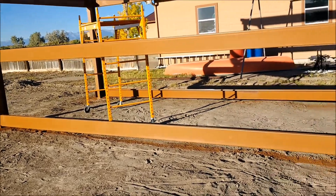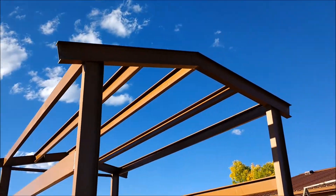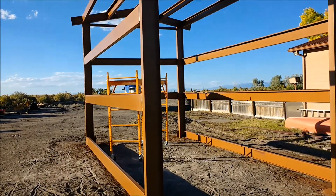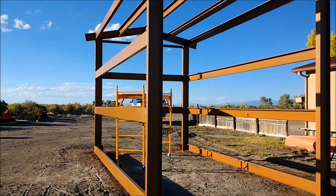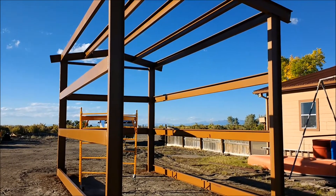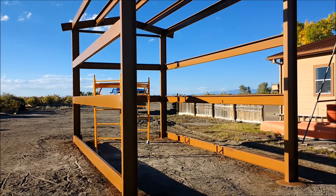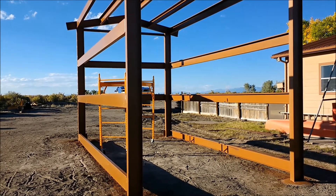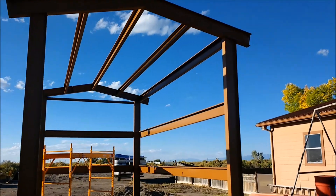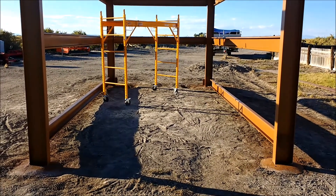My plan was two coats on the bare-metal I-beams and one coat on the C-purlins already coated in primer. The two gallons went pretty quick — I sprayed the whole thing in about 30 minutes including moving my ladder, getting one coat on the bare steel on both ends. I ran down to Sherwin-Williams and got five more gallons, so I ended up spraying five gallons total with about two gallons left over. Those last three to four gallons took about two to two-and-a-half hours, and at least half that time was moving ladders and scaffolding.